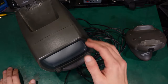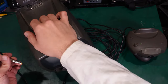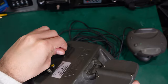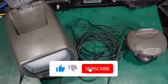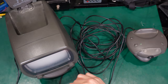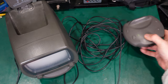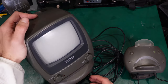Let's try to plug everything in. First I'm going to hook up the monitor with the receiver, and we can of course unplug the battery pack and use a standard DC power supply — the positive is at the tip. And I'm going to hook up seven and a half volts — that's what I believe is correct — seven and a half volts for our camera. So let's point the camera at my electronics bench and we should be able to turn it on.